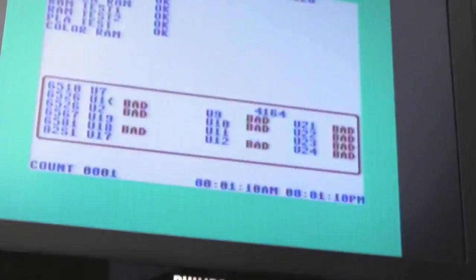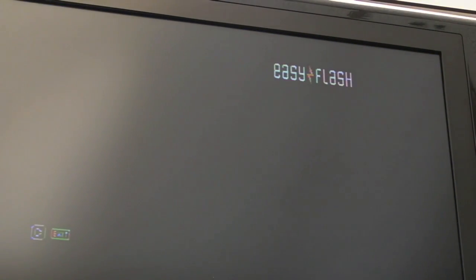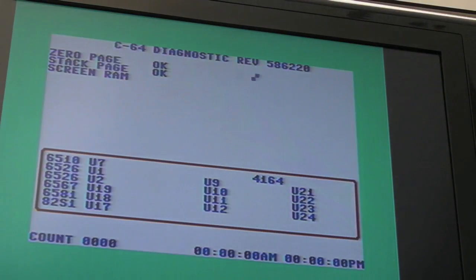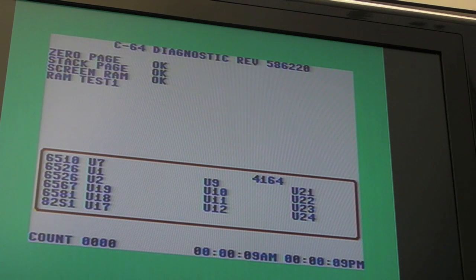Just touching the caps shows we've got some bad results reported back — just me interfering with the capacitor. The slightest effect in capacitance on that CAS RAM pin makes a huge difference to the timing for the DRAM. What I've got here at the moment is a 68 picofarad cap. I tried 47 picofarads — it was a lot better, still a little bit glitchy, occasional RAM issues. Changed it to 68 picofarads and it's been rock solid.